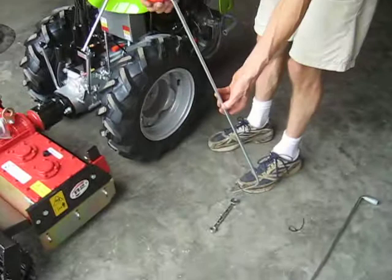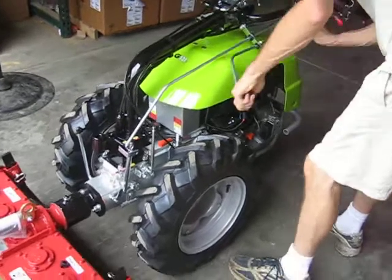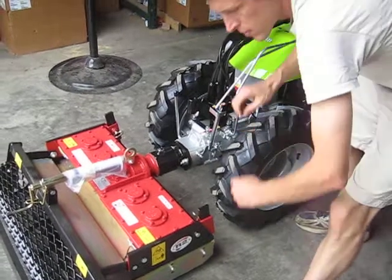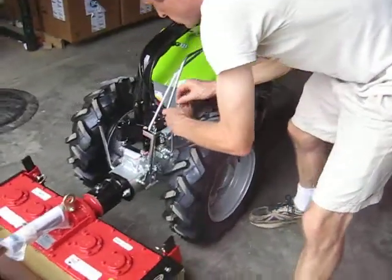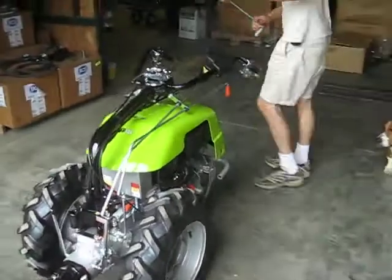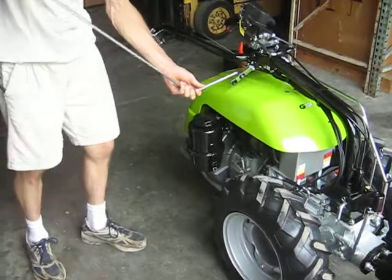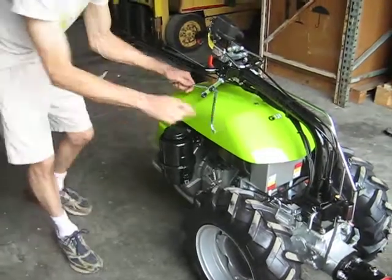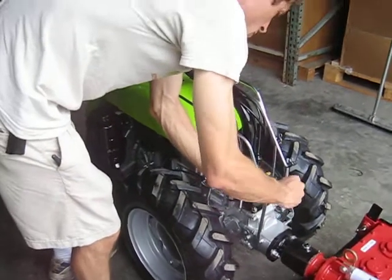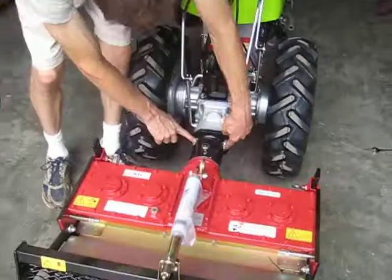Next, we have an orange handle, curve, on the outboard side. Joint. And washer. Finally, on the other side of the tractor, the PTO shift lever for the engagement of the implement. This can go in either hole, it really doesn't matter since there's only one shift lever on this side. Ready to mow. Now we just need to change the implement using the two large nuts on the back of the power takeoff.